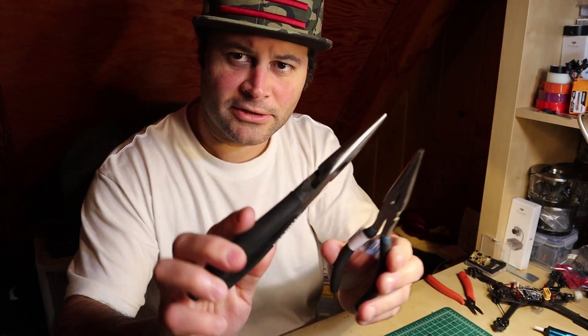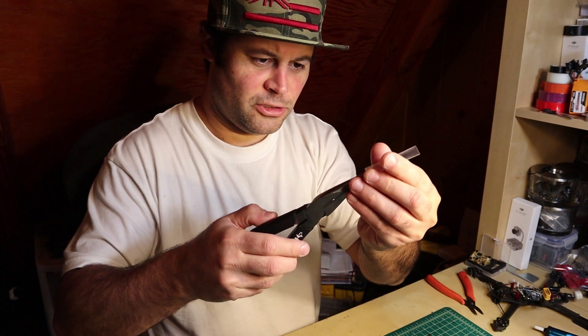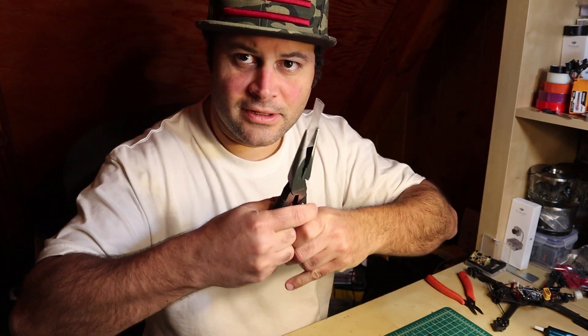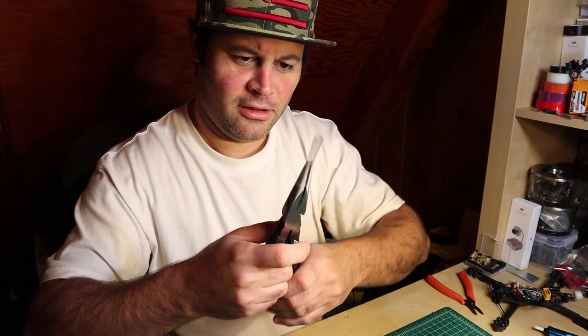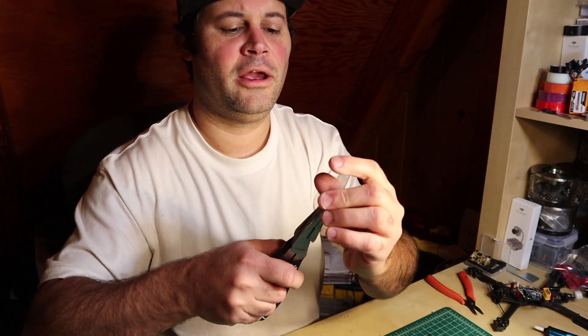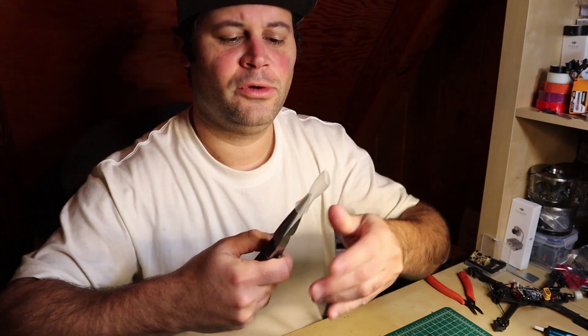What I like to do is twofold — it helps with the thickness of the shrink tubing, which helps with cooling, and it allows you to get small shrink tubing into a large area. I like to have different sizes of needle nose pliers. If you try to get this in here, you'll realize there's no way you're getting past the capacitor. So what I do is work my way through, stretching it out — I feed the needle nose pliers in from the outside and work my way into it kind of slowly, because if you pull too hard in one shot you're going to rip it.